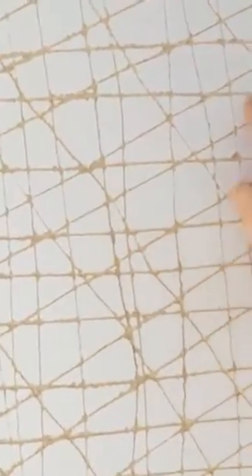If you google it there is so much conflicting evidence. This is the first coat of tiles I've put on and all I did was test the surface of the emulsion. If it was flaky, get rid of it and sand it down. However, if it sticks, simply scoring like this will give a good bed for the adhesive. Rubbing it down with a good grade sandpaper also gives adhesion.